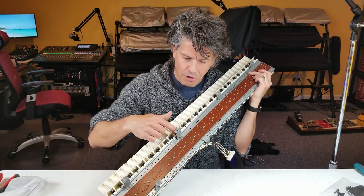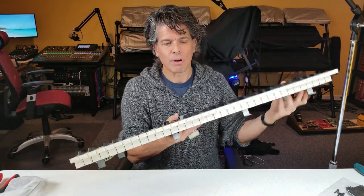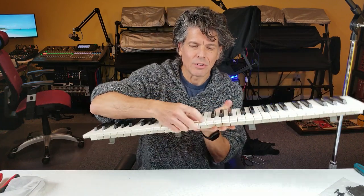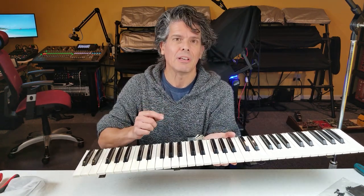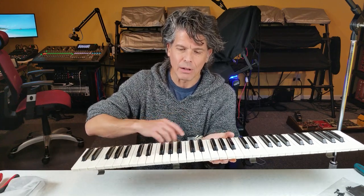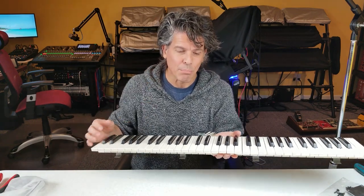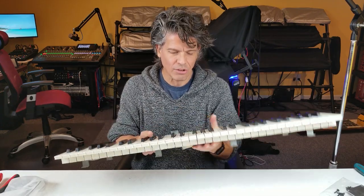You have felt both on the way down and on the way up. That means that when you press a key, it lands softly and gently instead of hitting hard against a piece of metal on the frame. That comes from pianos, because pianos use felt to cushion their keys as well. If you didn't have that felt and the keys were just hitting a piece of metal, it'd be like trying to play the counter — your fingers and joints would get pretty sore pretty quickly. So that felt landing is what gives it that soft feel.